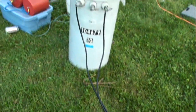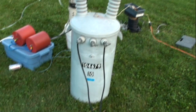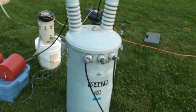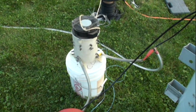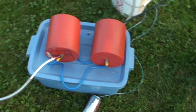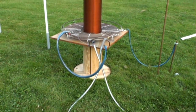Then coming out of that, we flow across here, traveling across the backyard — two number 2 aluminum conductors into what we nickname here a pole pig. It's a 10KW, 240 volt — technically our primary — and our output is 14,400 volts. From there we go through our spark gap, which has a fan on it to blow the spark out and help keep it from detonating. Two capacitors here in parallel, little ones. And from there we feed the power out into the primary of our Tesla coil.